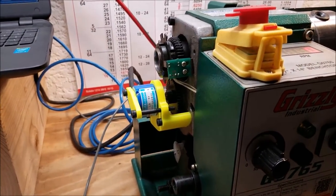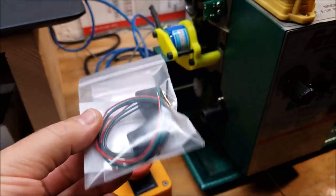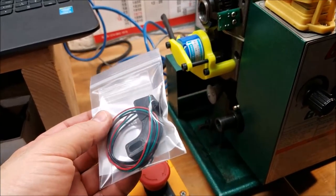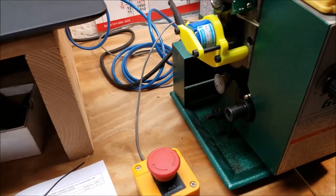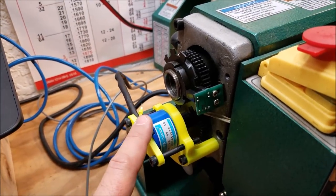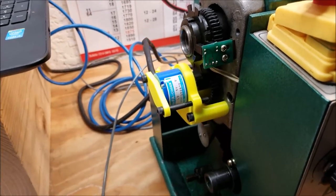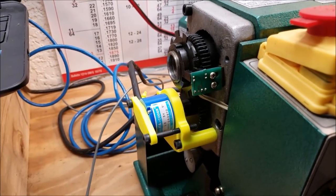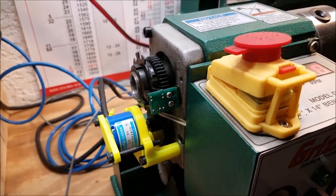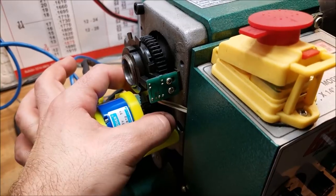All right, so just real quick background. If you're used to Mach 3, then you're used to the world where you only have one pulse per revolution that you can throw into your Mach 3 software pretty easily using a Hall effect sensor or a photo sensor, something like that. But that's one pulse per revolution. In the Centroid world, we have 8,000 pulses per revolution. So that's 8,000 times better than one pulse per revolution, right? Very accurate.